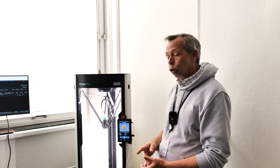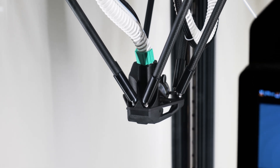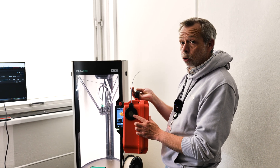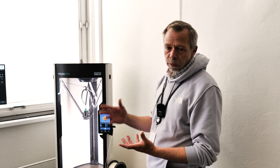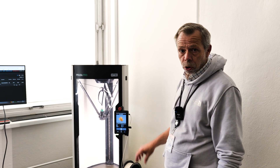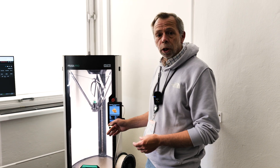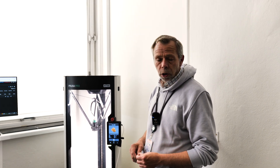With the HT90 you get two extruders — a high flow extruder and a high temperature extruder — along with a very nice orange dry box with built-in hygrometer and Bowden tube. That is a passive dryer, so the box is filled with silica beads. You basically dry your filament out prior to putting it in the box, and the box then keeps the filament dry. We've had a quick demonstration this morning with the guys who talked us through it and showed us how it works.